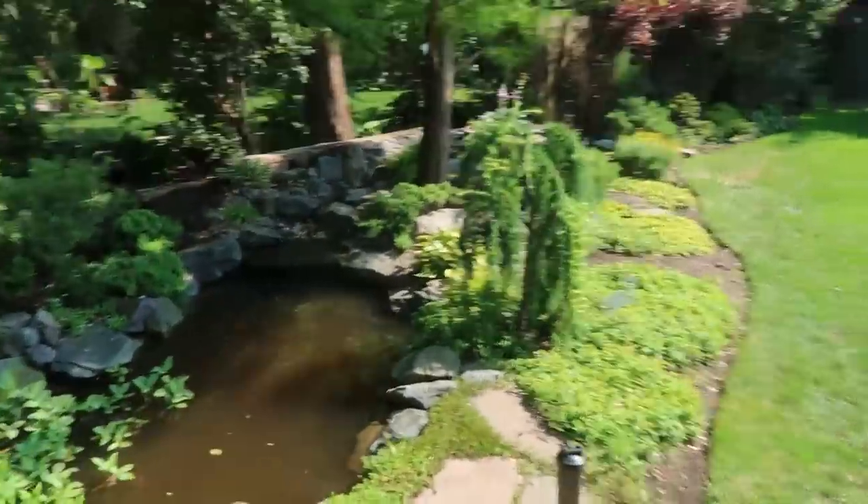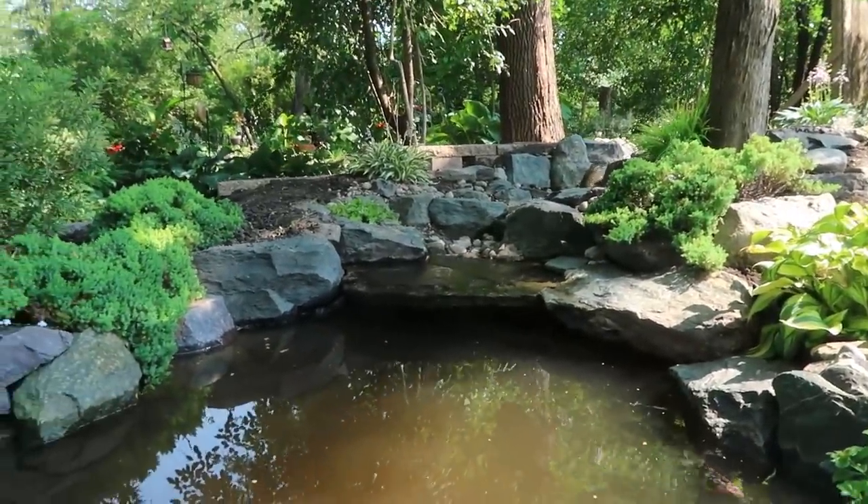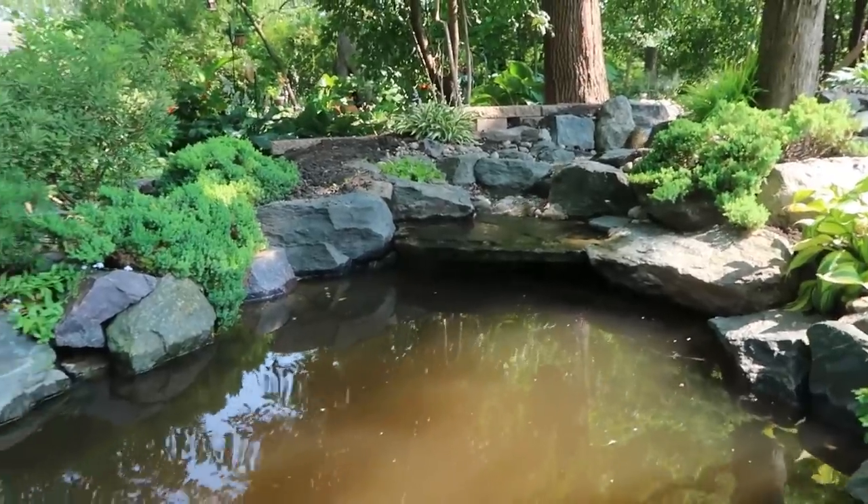It's a much different day than the last time you saw us out here in this beautiful boutique riverside backyard. It's just Jack and I. We had to get some edges done now that the dirt has dried out, do a little bit of work in the skimmer, and put the check valve on. It was an old-school vertical sump pump, so we had to retrofit a check valve. Jack just plugged the pump in and it looks absolutely fantastic. Here comes that waterfall!